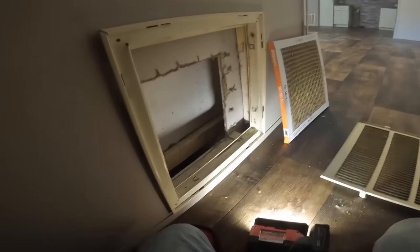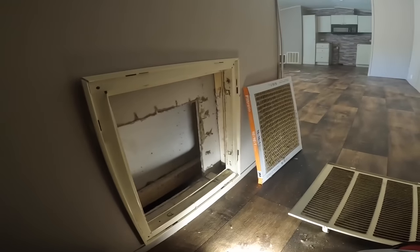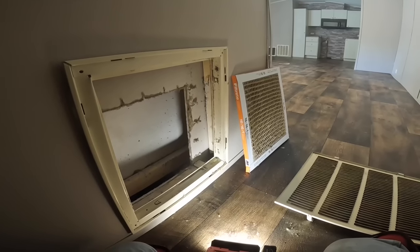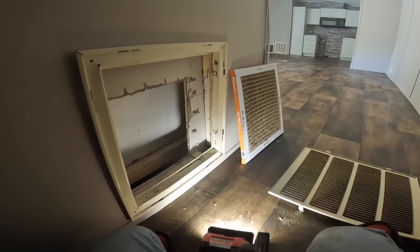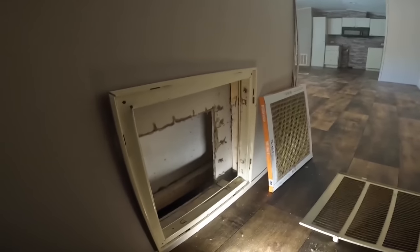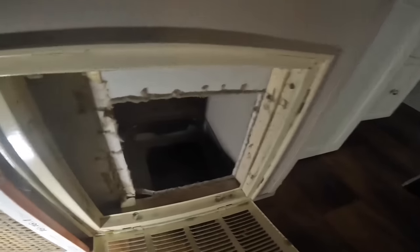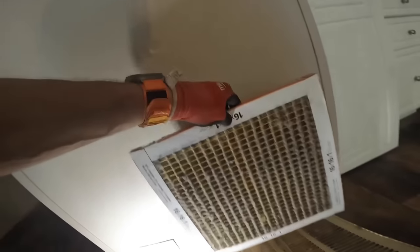All right, so why would I get a better suction pressure when the panel's off? Maybe because the ECM motor ramps up a little bit. That's all I can think. Look at this one. It goes right into the air handler. Much better airflow access. That's just going to have to be there until I can replace it.